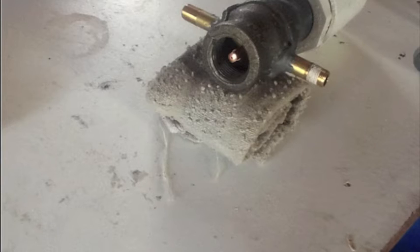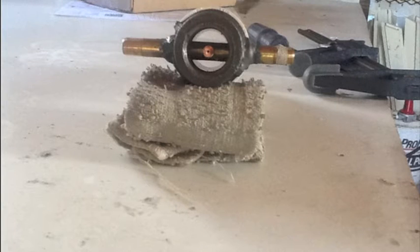This photo shows you the MIG tip going into the four-inch brass nipple. It looks like I already have the JB weld on there, and that was held in place using that plastic fitting just to push it in so I could keep it centered while the JB weld was setting up. This is old footage so I apologize for it not being very organized. And there you can see the MIG tip shooting straight down the center.